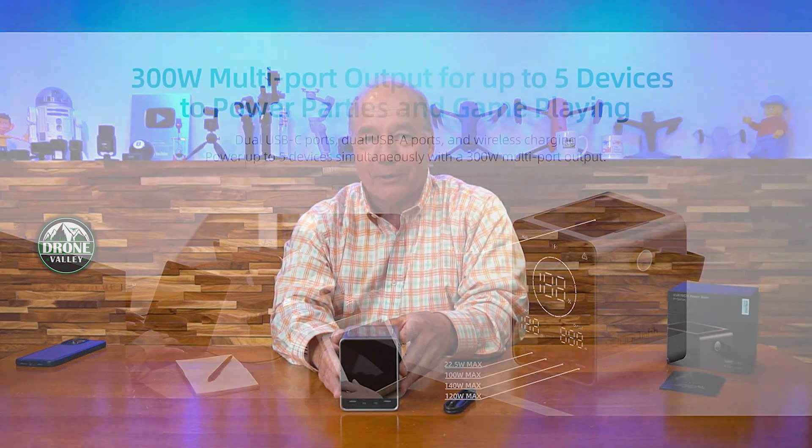The two middle ports are USB-C PD ports — Power Delivery — which do the same thing: when you plug in a new phone, tablet, or PD-compliant drone batteries, they interrogate the device and adjust voltage and current to charge it quickly and safely. The big difference is this unit enables PD 3.1, the very latest PD standard used on most laptops. You wouldn't think something this small could charge a laptop, but this is as big or bigger than the charger you use at home. So out in the field, you can charge your phone, tablet, drone batteries, and your laptop — which most battery banks simply can't do.